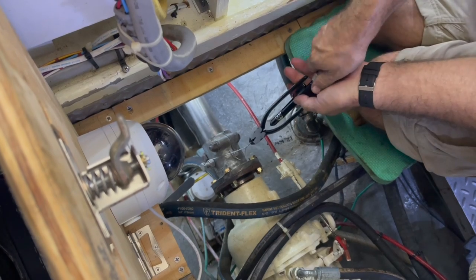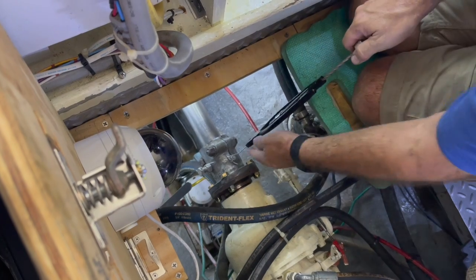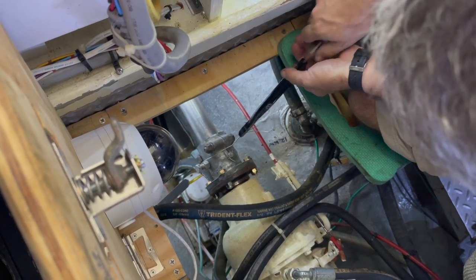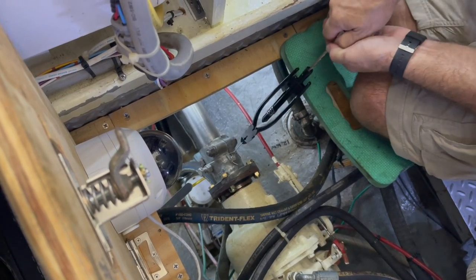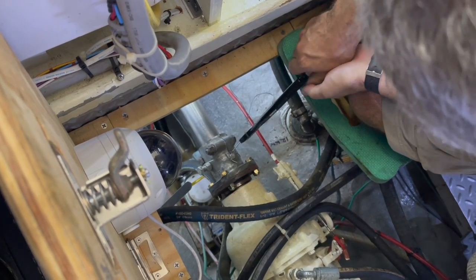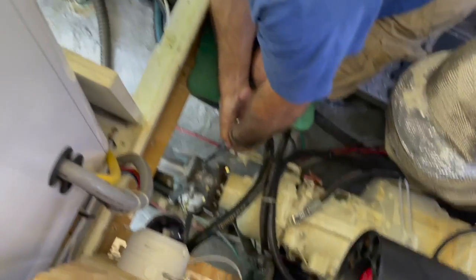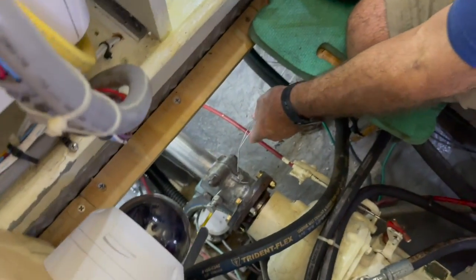So you can see I'm spinning it down. I'm going to go around this pin. Put a little tension over here. A little more. A little more. A little more. And it's about as much as I can do. So I'm going to let this go. I'm going to unlock the handle now. And you can see I have this beautiful little spiral seize there.